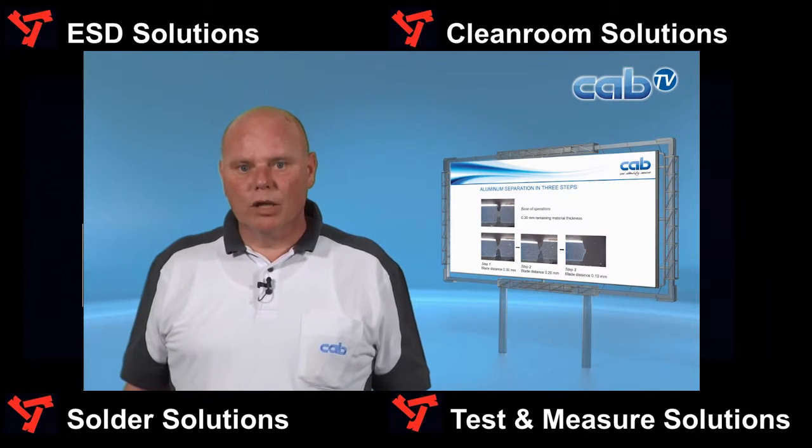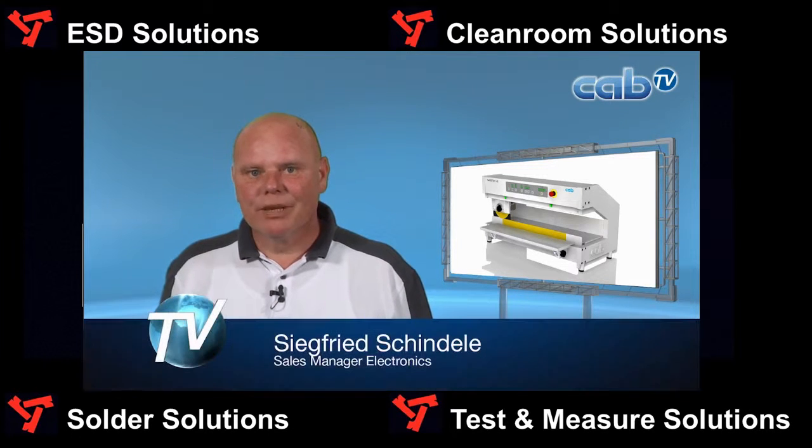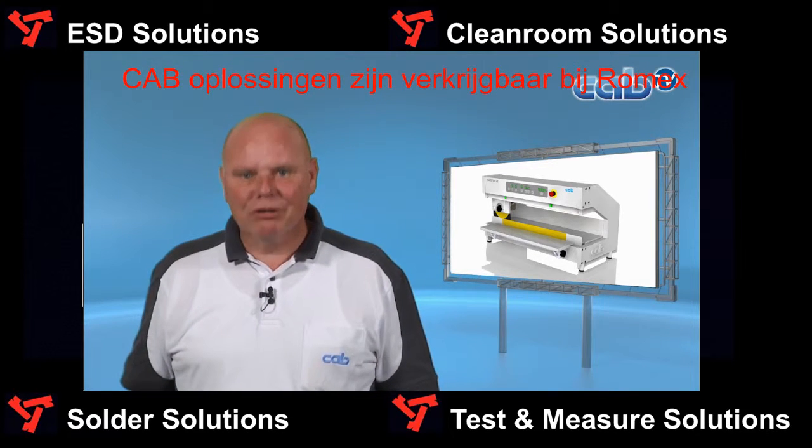Let us summarize what we saw. The pictures of this slideshow are micrographs of the pre-scored groove after each cut, starting with 0.3 mm remaining material thickness. After the first cut, there occurs a slight deformation of the pre-scored groove. After the second cut, the deformation is clearly visible. The PCB is finally separated with a third cut. Hopefully, my last descriptions will help during your daily work, and I would like to thank you very much for your attention.